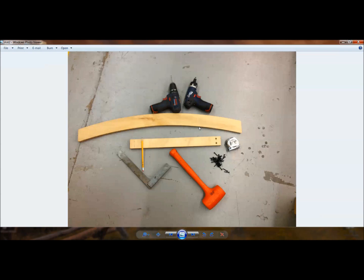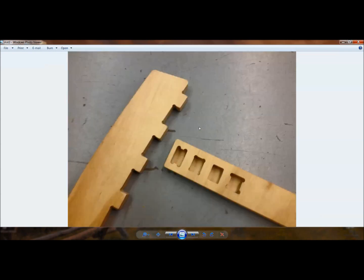It took quite some time to put these projects together. When I started with ShopBot, I was listening to Ted's speech about building complexity into the part. The ShopBot CNC machine can cut a curve just as accurately and efficiently as it can cut a straight line, so why not build those features into your parts? He made a good point about making one part complex versus having multiple complex parts. For this patio chair, I wanted the ShopBot to do everything — the only thing needed would be a bottle of glue.